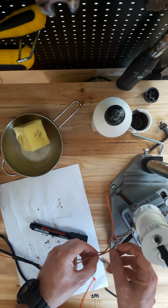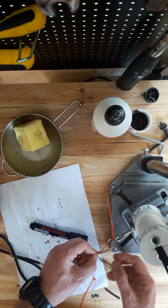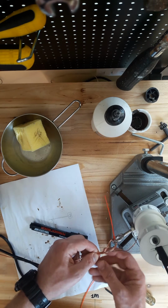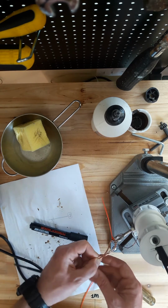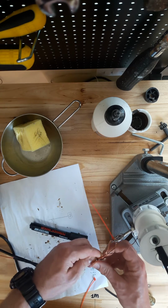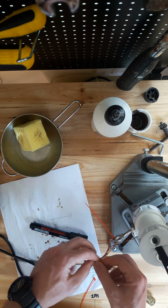the feed point, the wire from the ladder line, so that's all going to twist in there. I'll just leave this a little bit slack so that when it's pulling in the wind, it's not going to pull this at the same time, so leave a little bit of slack on that. I was just looking at that earlier on, so we'll just twist those together.